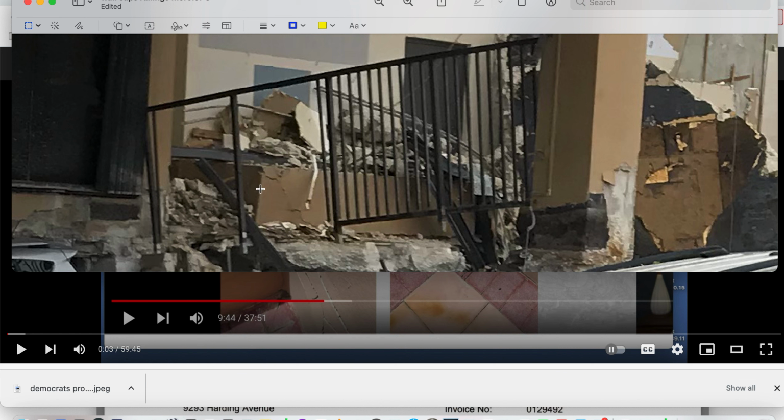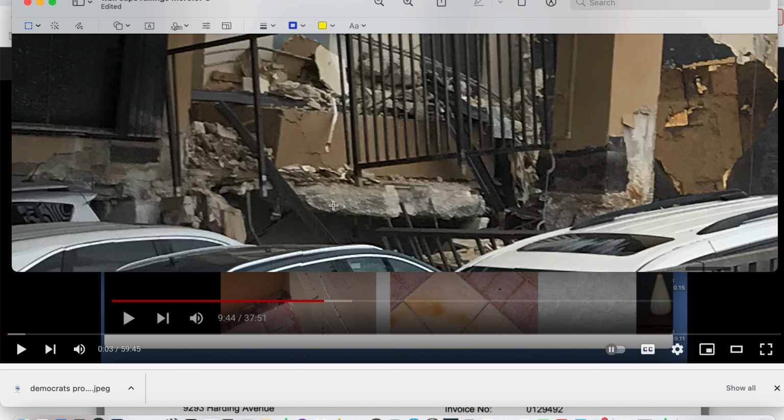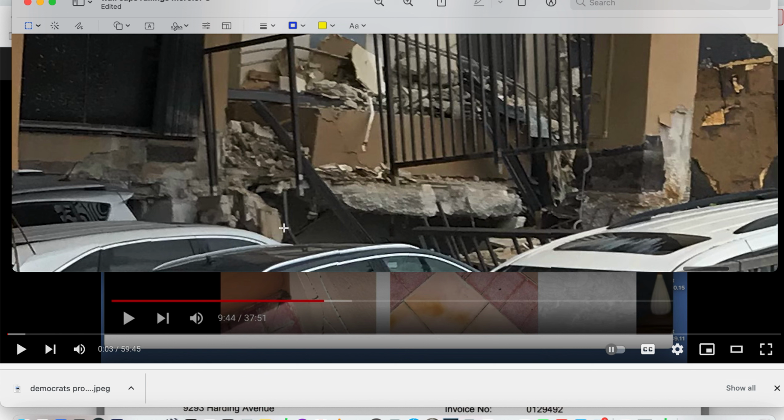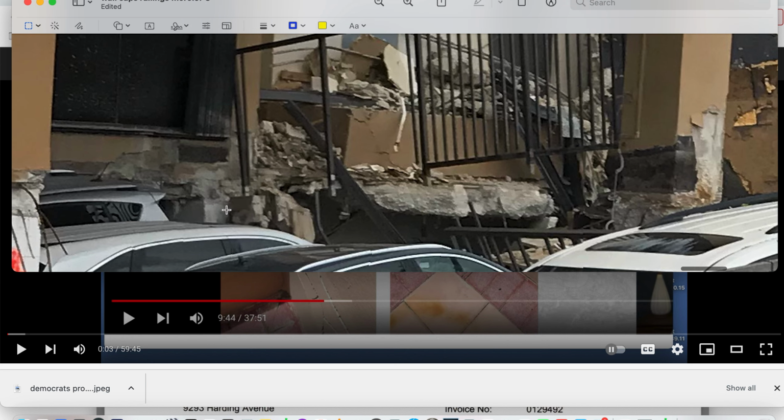Counter wall here, remember? Counter wall, little mini wall? There's a counter mini wall there. So there should be a fracture right about here where this is a middle section that took a dive in. All right, I have to resolve all these cracks, everything I can see, observe. So then again, we have the floor cracked here. This is identified here. As we look at this, we don't quite see rebar, this direction. I don't see rebar coming out of here. This appears to be a column. And that might be one of the, coloration's got me. But nevertheless, here's our fracture line here. And this looks like this was part of that wall system.